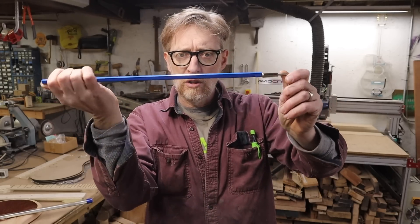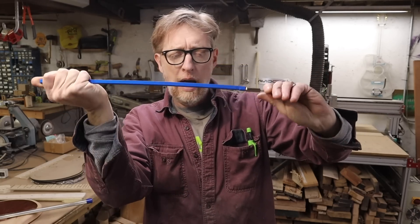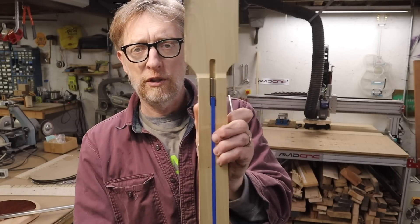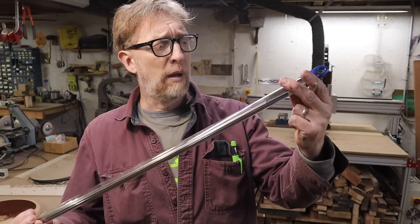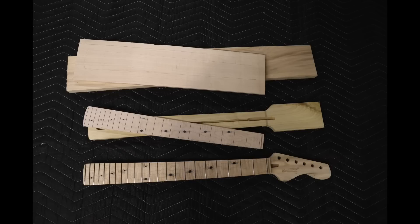I'll put some links in the description - they're not affiliate links, I'm not trying to make money off this. What I use for truss rods are these very basic two-way truss rods, they're 18 inches long. You can turn the Allen key one way and it'll bend down, or turn it the other way and it'll bend up. The truss rod slot designed into these necks is designed for this brand of truss rod - you'll see it fits perfectly right in there. For fret wire, I buy it in bulk, but you might just need to buy enough for one guitar, which you can easily do on eBay - you can even buy it pre-cut. Next time we'll talk about how to do all that, and you can do it without spending a million dollars on tools. Be good.